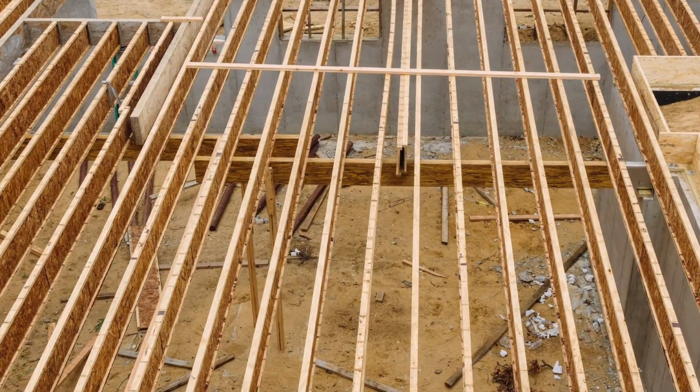The footing of the foundation, the stem wall, or the actual wall of the foundation that you see, the sill plate, the piece of wood that sits on top of your foundation wall, the joists, that's what your floor sits on, those 2x6s that run 16 inches apart, and then on top of that, your subfloor. Once all those pieces are fully connected together, your wall can't move.